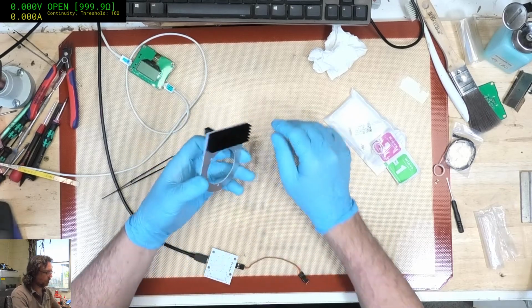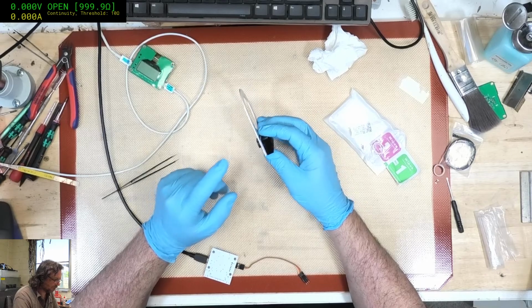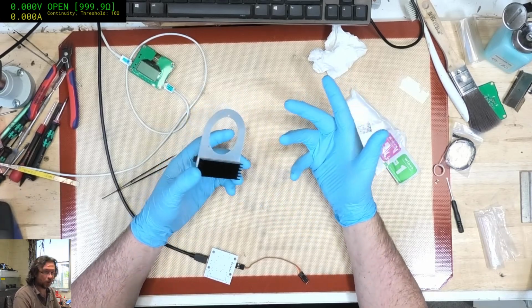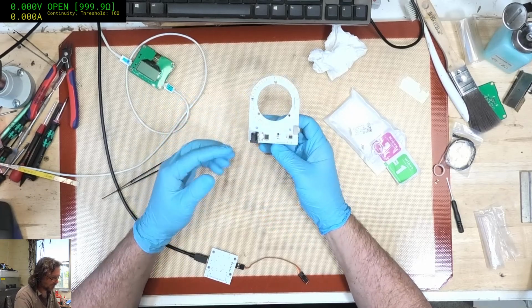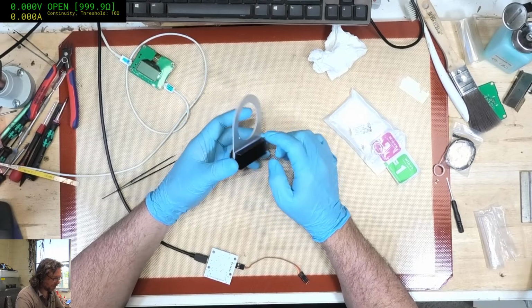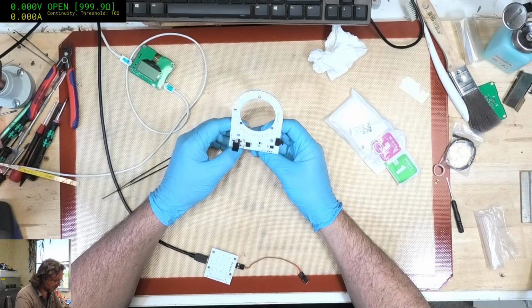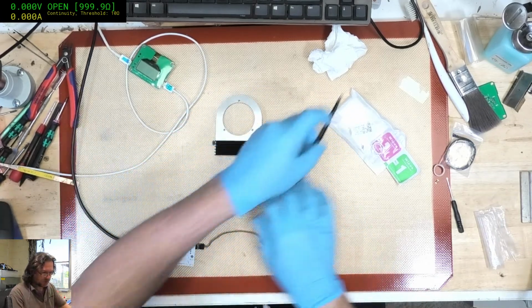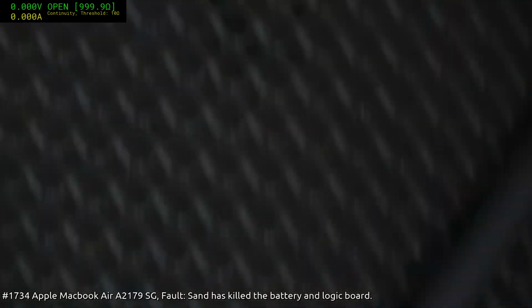There we go. And that's that. Now, you're probably saying I really should have a heatsink around here, and I concur. It would be nice to have some sort of finned circular thing. But given that it's an aluminium board, a fair bit of the heat does get down to here, and we're protecting the actual circuitry here. Anyway, so that's done. Let's plug it in, let's install it, and it should be absolutely no difference to the existing one.